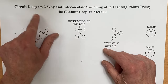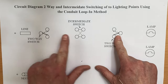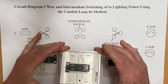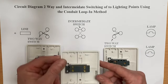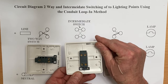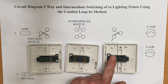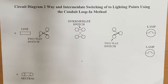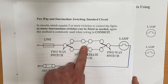This is a circuit diagram, and while we've talked about wiring diagrams, you can use this circuit diagram to help wire the circuit — but there are things to consider. For the two-way and intermediate switches, in the drawing they're shown side-on. If I turn one over, you can see we've got the switch in the side-on position, but in real terms it would face the other way. When using it as a wiring diagram, consider where conductors go in the side position relative to its proper position — we have a common terminal, L1 and L2, and four terminals in our intermediate switch.